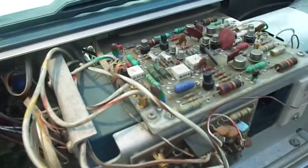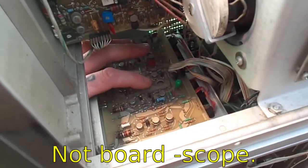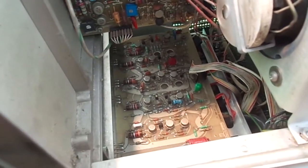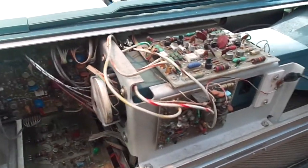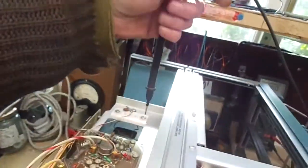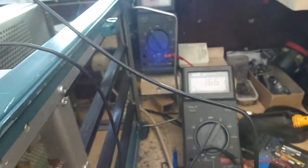The only way really to do this is to go round the whole board. I'll fix a probe lead to the 15 volts and then go through the whole board and see where they come out. I've tried to look at the manual but it's less than clear. I've gone through the whole scope — all the bits I can get to at any rate — pulling off all these plugs that provide power.